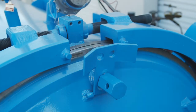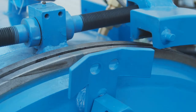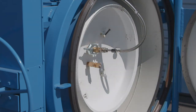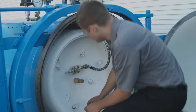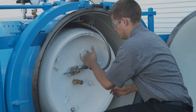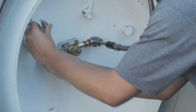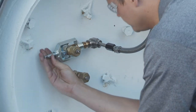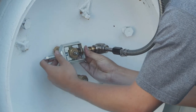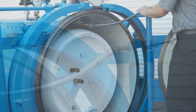Next, turn the yoke bolts using the chain drive hand wheel. When the yokes fully clear the closure head, the door may be swung open, giving full access to the inside of the Clortainer. When the door is open, turn off the interior gas supply valve by giving the cylinder wrench a sharp wrap with the palm of the hand. Draw any residual chlorine out of the interior supply line using the vacuum regulator and disconnect the interior gas supply valve using the ton wrench. Place a golf tee into the yoke adapter to prevent moisture from entering the interior supply line.